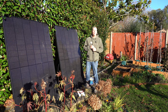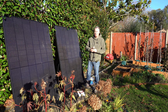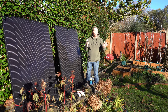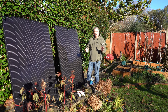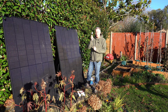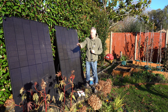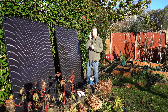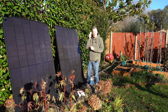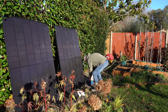So you may think you've got a solar panel system and if the power fails externally, unless you've got a special system, the average system installed on a house and a DIY system just turns off. It's a safety issue for people who could be working on power lines external to the house. These microinverters have to be approved and they have to prove that they do this. The basic design architecture makes it impossible for the power from the panels to appear at the output socket.